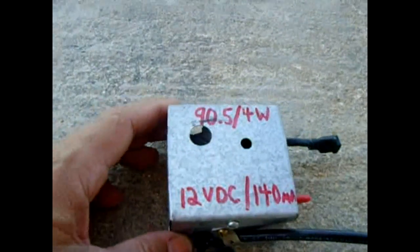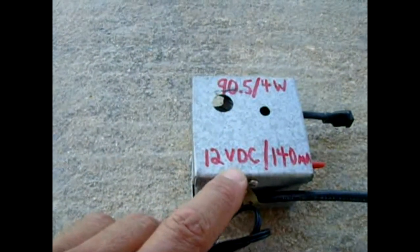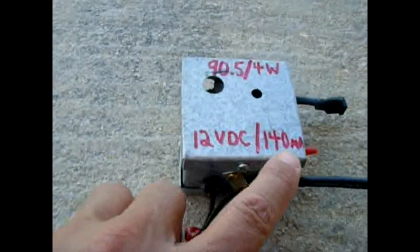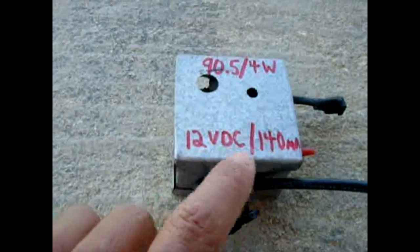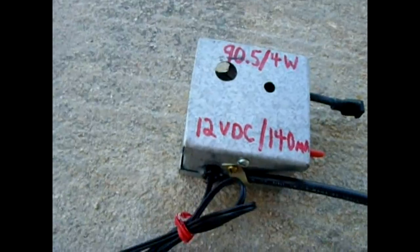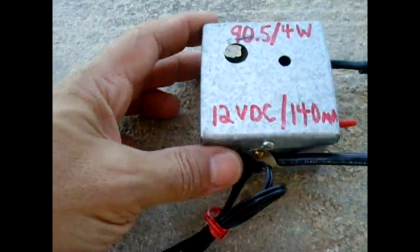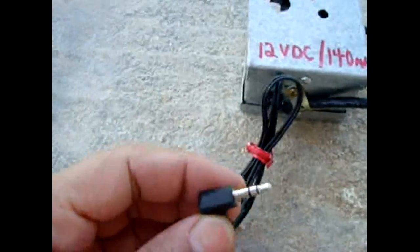They say 4 watts and it probably is 4 watts. It says you can run it between 12 and 16 volts. I have it turned down — I could run it at 12 volts at 170 milliamps, and if you run it at 16 volts you're probably pushing 280, maybe 300 milliamps, which I wouldn't want to do because the transistors run pretty hot as it is. I like to run it at 12 volts at 140 milliamps, and I have this connector right here.